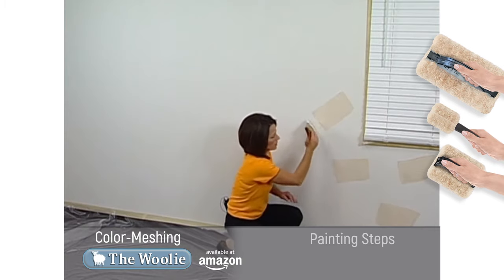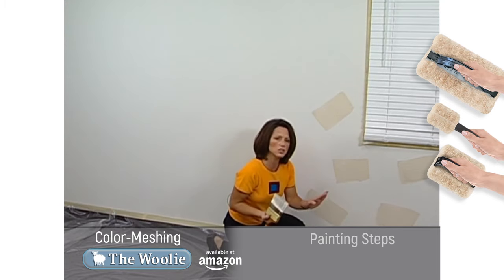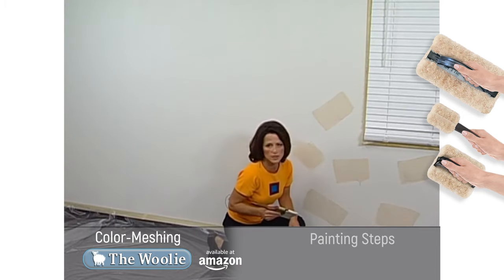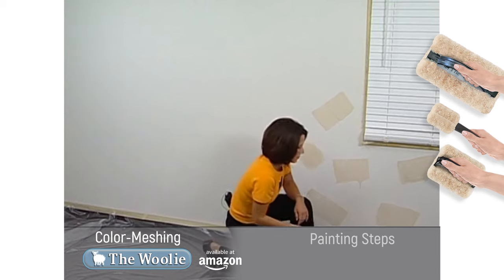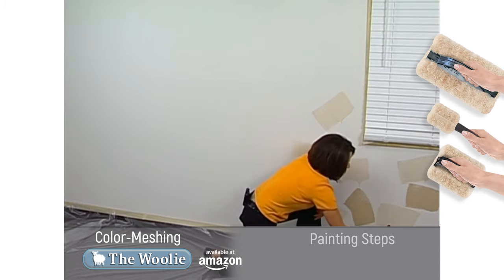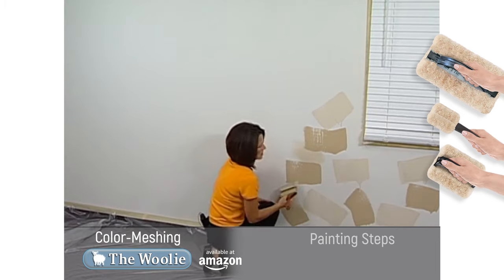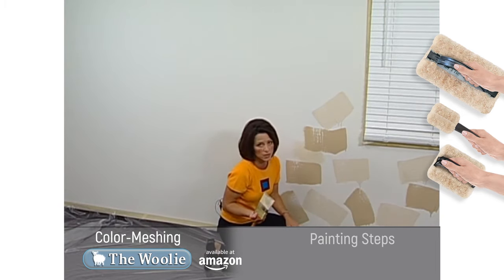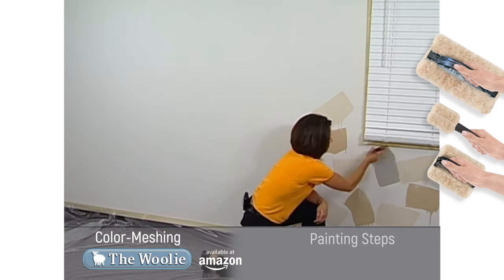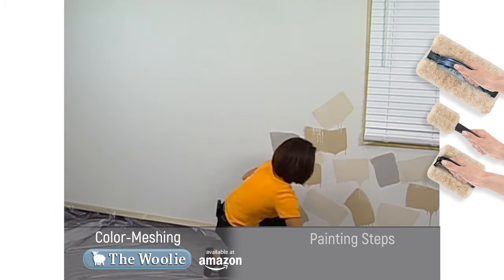We're working on about a four foot by four foot area at a time. Apply the paint in heavy splotches to the point that they're actually beginning to drip — that's an essential part of the process. If you apply your paints nice and even and smooth, that's not going to stay wet. Take the same brush, dip it into the next color and apply more splotches. What we really look like we're trying to do here is break every rule for painting — and we probably are — but the outcome is fabulous. You only need to use two colors, but you can use as many as six. You don't need to have equal quantities of all the colors — you can have a little bit more of one color or another.